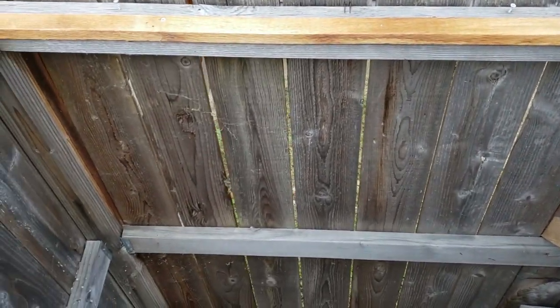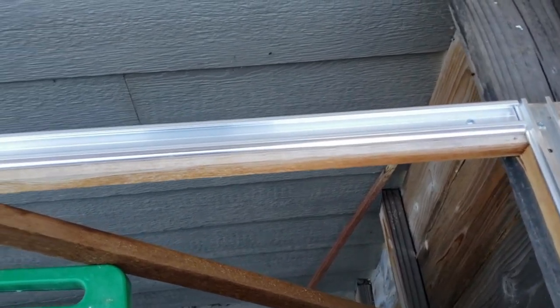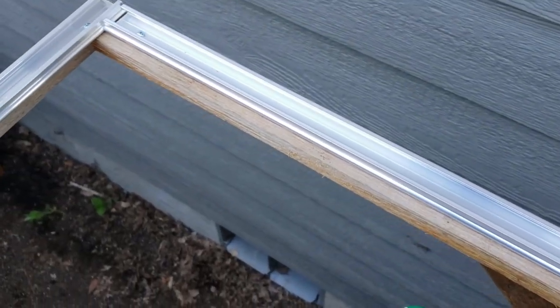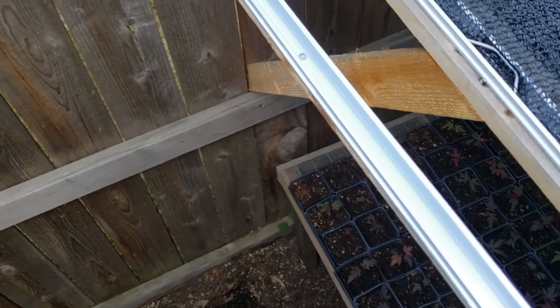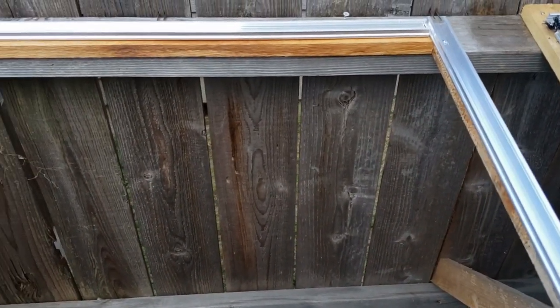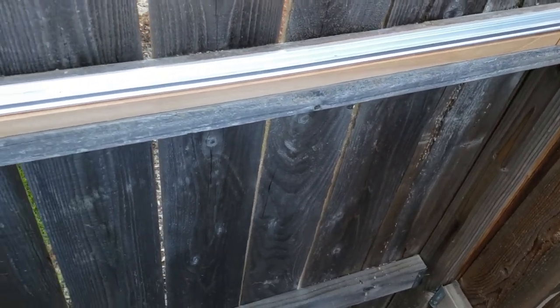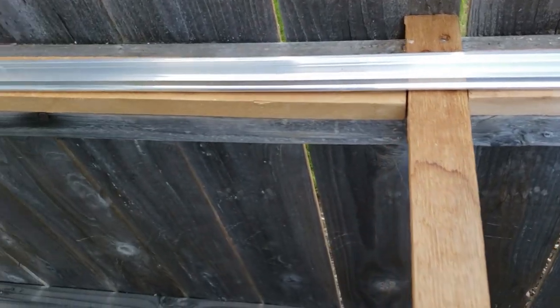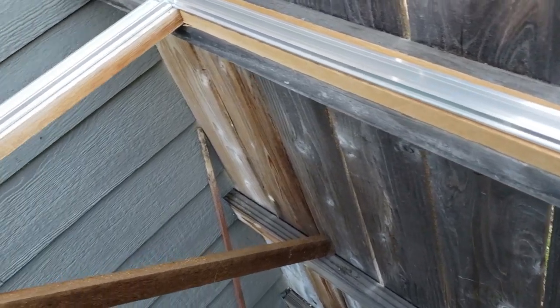Then I will cut the smaller piece to go right here. I have track on the back as you can see there. I have track on this side, goes around, and I have track on that side. Now I'm ready to attach the shade cloth with the wiggle wire, and I found it works best if I attach the shade cloth to the back first and then attach it to the front. So let's get the shade cloth over this and then we'll attach the wiggle wire.